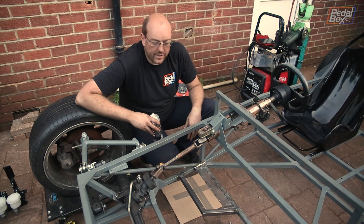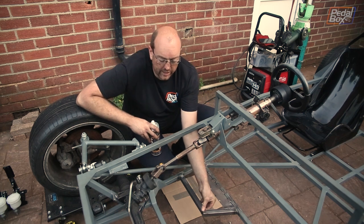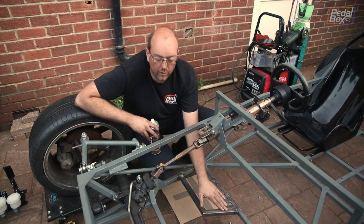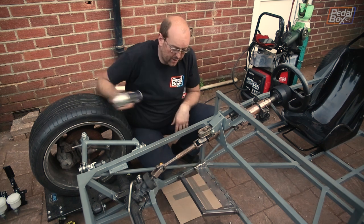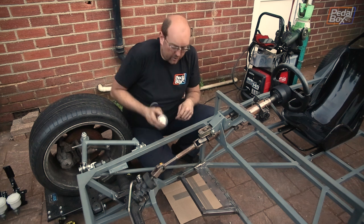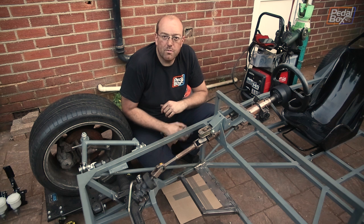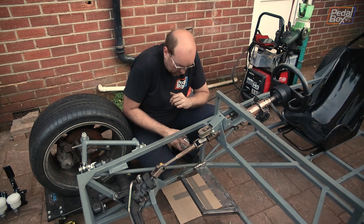That's just about done for the day. We've welded in a piece of angle round here for the backstay, joined them together, and this will eventually form part of our tank support. In the meantime, we're just going to spray a little bit of primer over it so it doesn't rust overnight, because once again we've primed the car and then welded onto it more.